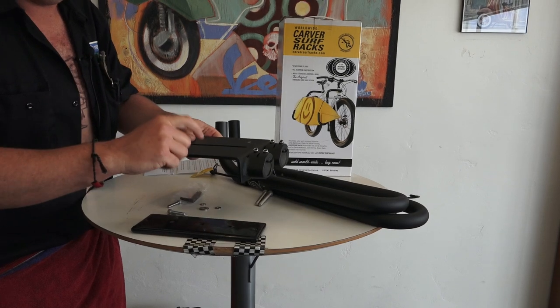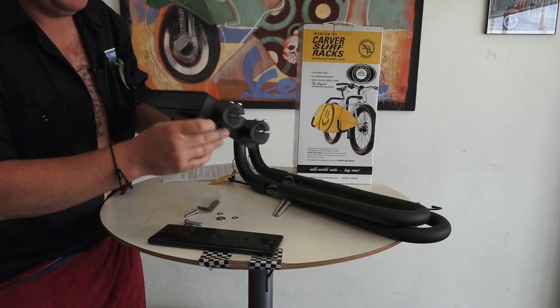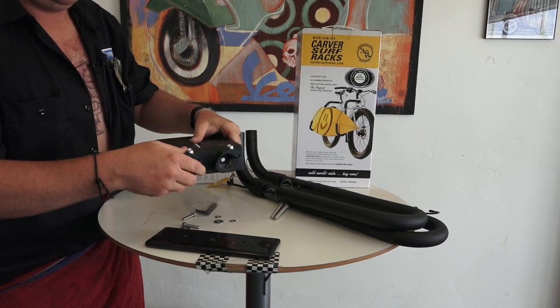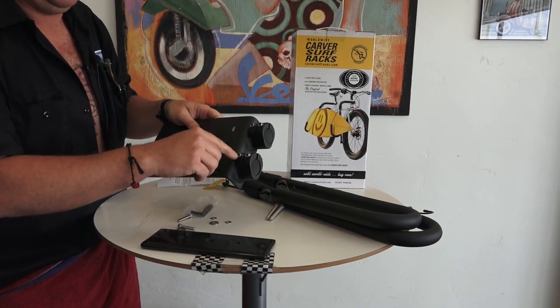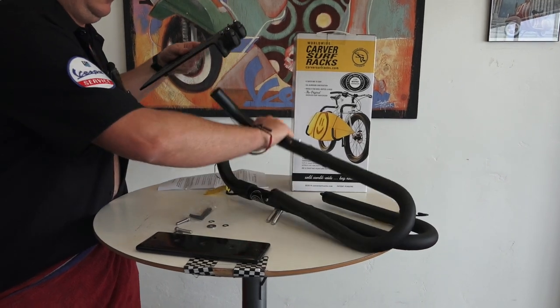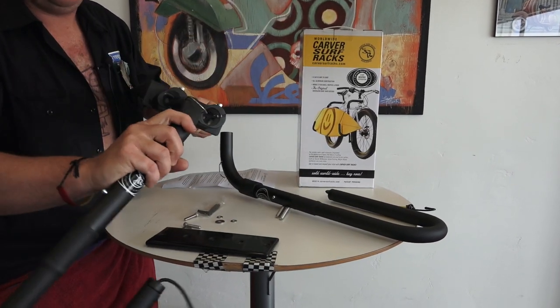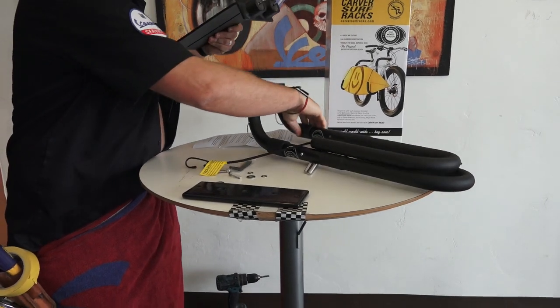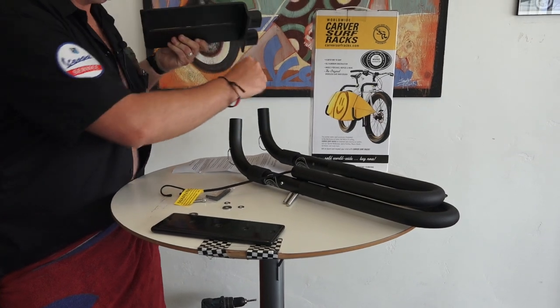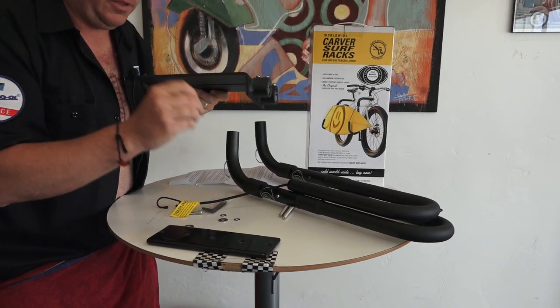By the same token, this is an aluminum plate that's bent. It's like 3/8 of an inch thick. It's got these mounts, and these are a pinch style, so you can install this bar and install that bar and pivot it at any angle. Once you install those bars, these short screws are important. Those pass through and thread into that. Do not forget to install those.